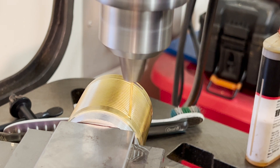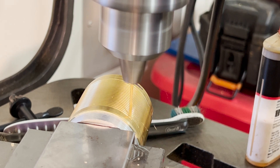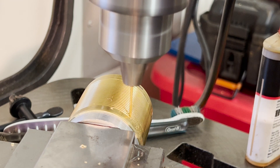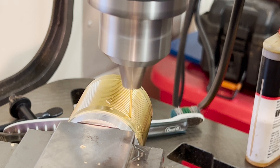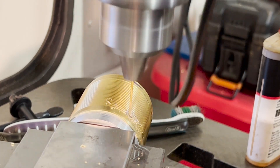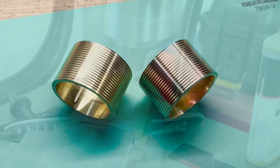You need to drill a hole for the line and it needs to be at an angle. I put it in a 5C holding block to keep it fixtured, and it makes pretty easy work of coming down. That's running three thousand RPM with a one-sixteenth inch drill bit.